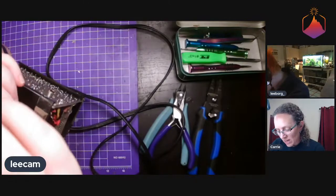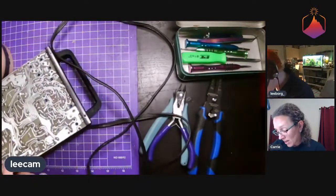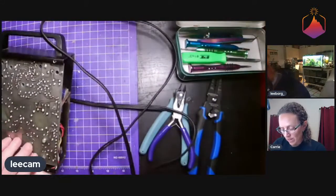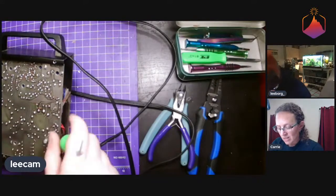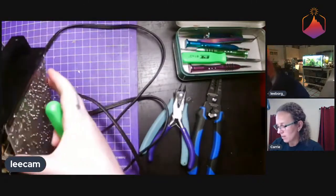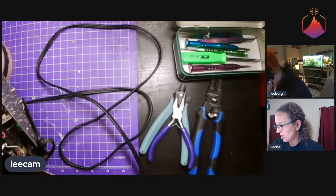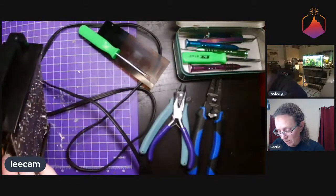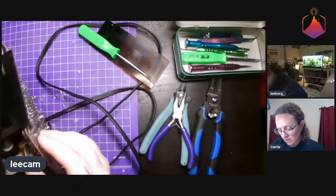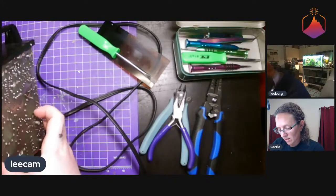So sine wave is up to 200 kilohertz, and everything else, square, triangle, ramp, and staircase, is up to 10 kilohertz. So, not super speedy or anything, but not bad for something you can just stick on a bench and power off a battery. If you just need a repetitive signal, then there you go.